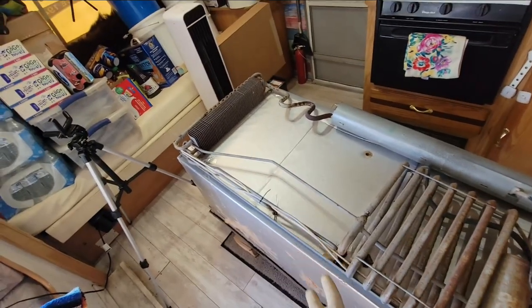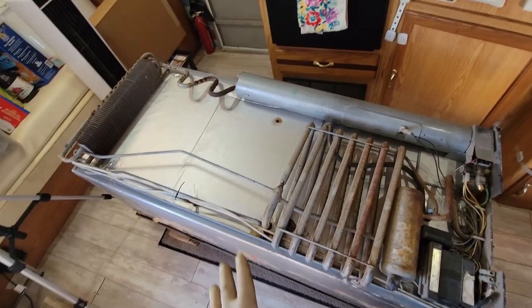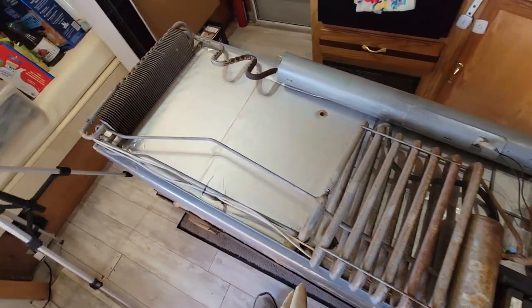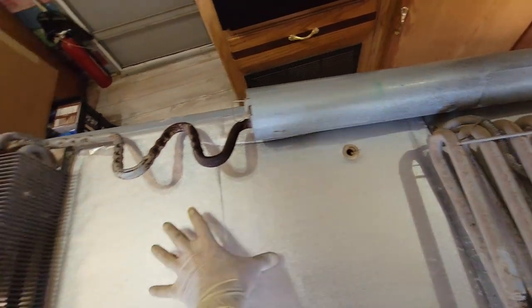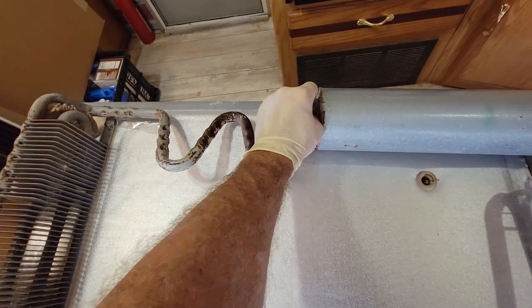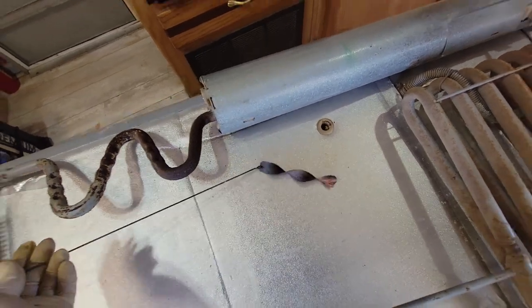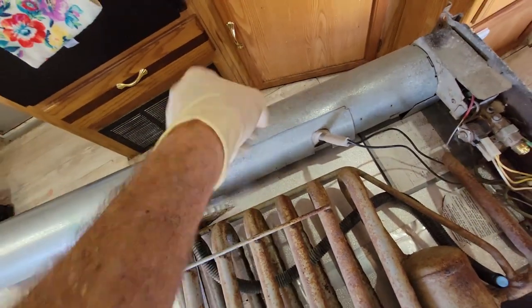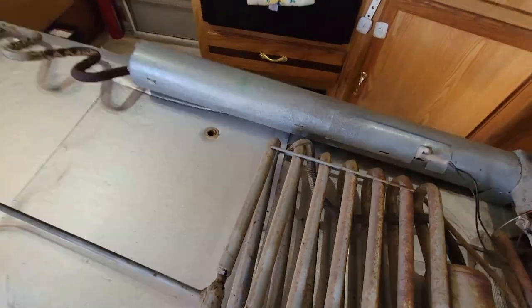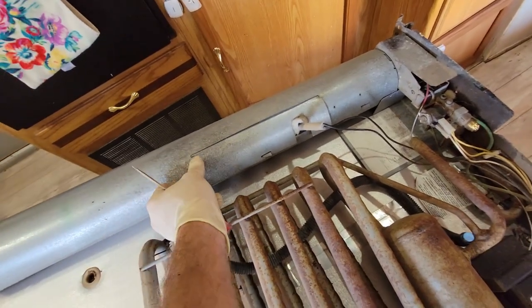Alright, so I've got it laid down and the screws on the inside are all taken out. The handles and hinges aren't being crushed. The next step is to disconnect all the control components of this refrigerator. It's hard to appreciate but this frame comes with it — this section right there is part of the cooling unit. I'll need the flue baffle — on aftermarket ones, don't forget to grab the flue baffle out of this one. Inspect it and make sure it still exists. Without it, the refrigerator will not cool on propane. These aftermarket ones also generally don't include a new heater element, which seems silly.